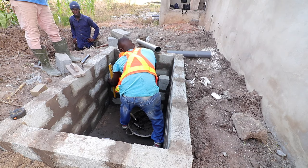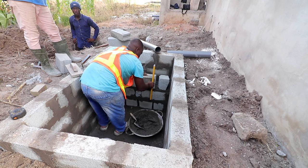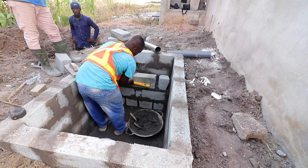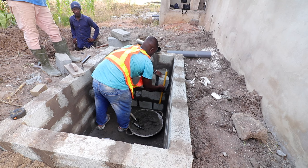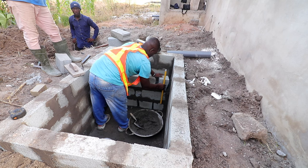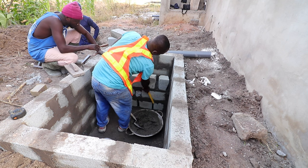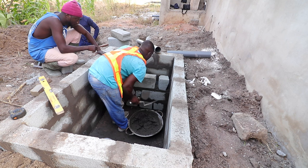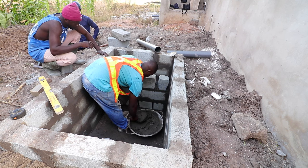During the installation of the traditional small soak away in the digester itself, the whole idea is to make sure that the chamber in which the digester bed will be laid is not disturbed. When there's excess water or an overflow, it must not come back into the digester bed. You are also creating room for the overflow pipe to work in case there's a worst-case scenario where the soak away also does not work. You are filling all the potholes and loopholes, solving all the situations that usually lead to problems that will affect the biodigester when it is constructed.